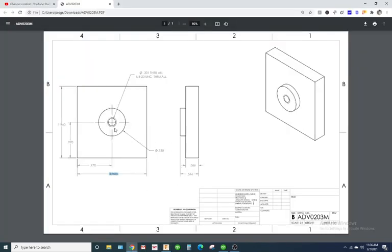Alright, so now we have a circle, or like a hub, that looks like it's in the middle of the part. We don't know if it's in the middle. Looking at the map, it looks like it's in the middle, but the information we have that's exact is it's 0.97 from the side and 0.97 tall. And this hub would be 3/4 inch diameter.